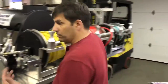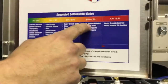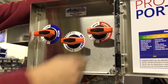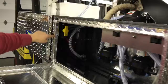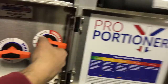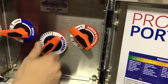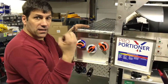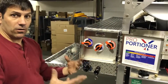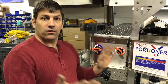Now we're ready to operate and pressurize our reel. Let's say we want to clean a roof and want a three-and-a-half or four-and-a-half percent mix because it's really bad. Come over to the proportioner, open the water valve all the way, take the SH valve — making sure it's set to SH from the bleach tank — and turn it up to four-and-a-half percent. Set the detergent anywhere between three and five, typically using Agent Clean chemicals or Dragon Grip, to get that surfactant onto the surface to blend with the bleach mix. Then spray and do all your cleaning.